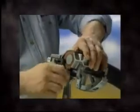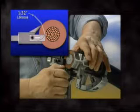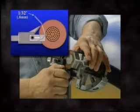Set the WS64U up in the same way, adjusting the blade to 1/32 of an inch, 0.8 millimeters, above the conductor. Slowly feed the tool by applying a slight forward pressure to engage the blade. Continue stripping by applying this forward pressure until the proper length of insulation is removed. End stripping of secondary voltage outer jackets or spacer cable is performed in the same manner.